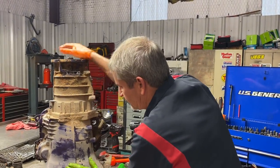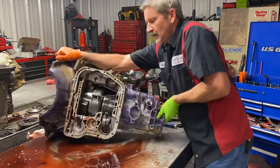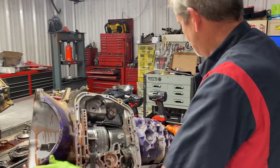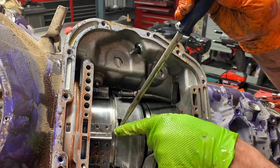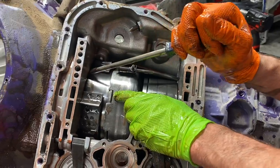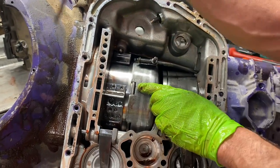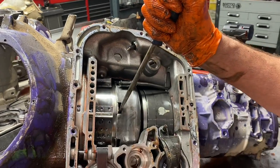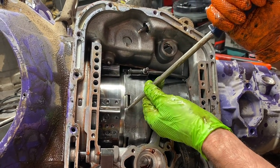When we check the clearance in the front of it, we have it standing on a stand over there and I put my dial caliper on it. Once we do that we'll be checking our overall clearance from here to here. When you're setting up clearances, if you don't know how, you can get so much clearance in here and next thing you know your shell's out here like that, or your drum's sticking plumb out of your shell. This is how the shell should stay. You can change the washer in the front of the pump, the washers between the drum, the washer on the end of the intermediate shaft. You can move this thing around so much and next thing you know your drum's out here with a big gap but your clearance is tight - well that's wrong, because it's going to start wearing right here and kick this drum out, take these corners off. You have to get that deep down in there.